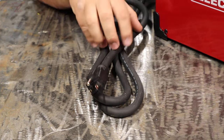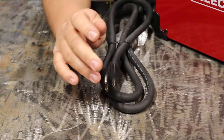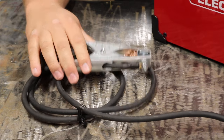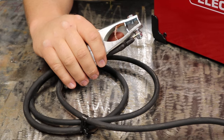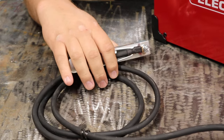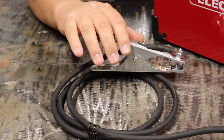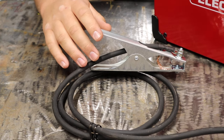On the back is definitely a much heavier duty, much thicker power input wire. This is probably roughly the same quality plug, but the wire itself is probably at least twice as thick as the FC90. And the last external part is a much better ground clamp. It has braided copper wire inside the ground clamp giving you a better connection on both sides. The other ground clamp on the Sentry model was definitely much cheaper. The cable is probably about the same, though it could be made from a little bit better material, at least the insulation — probably a little more flexible than on the FC90.